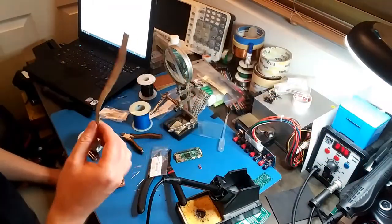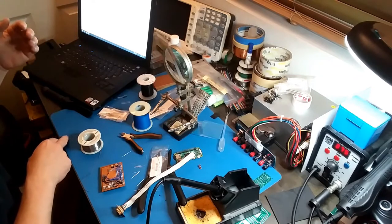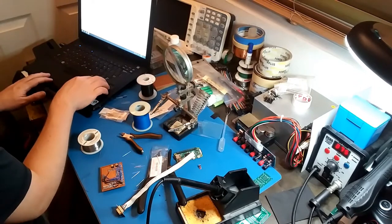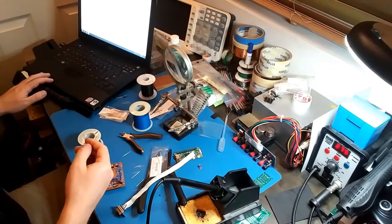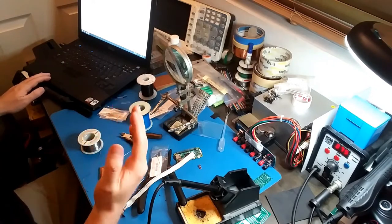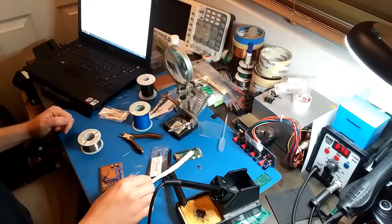I'm a little bit confused how this CGA connector goes on though, because the schematic says red, green, blue, B red, B green, B blue, but their cables page on their wiki for the IBM PC, CGA, EGA, Commodore 128, it says like red 1, blue 1, green 2, red 2, so basically the nomenclature is different. So I gotta figure that out first before connecting this thing.